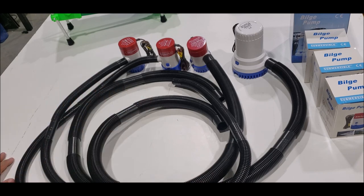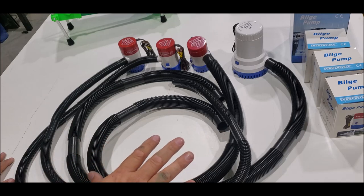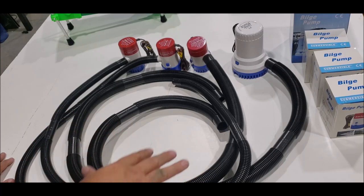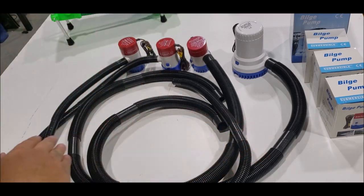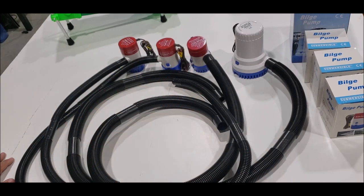That's what we've got going on with the pumps. I hope that helped you understand that bilge pumps don't build pressure, so you've got to upsize them if you're going to be running at a large height — going up four foot or so, or going down into the creek and pumping out of a hole. You're going to need a larger pump to get where you need it. Thanks guys.